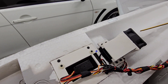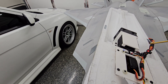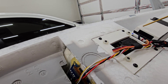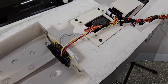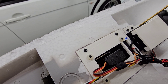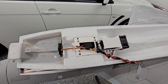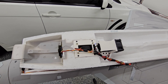This is a 40 millimeter fan that I got off Amazon — I think the fan might have been 10 bucks. I've got some stick-on heat sinks on the top of the air unit, and there's two more on the bottom. What it does is force all the air that the fan is pulling across those fins that are dispersing the heat coming from the air unit. This system is working really good. It can go for 15 minutes or so with the cowl closed, with just the VTX running, and it doesn't overheat at all. So with five-minute flights I haven't had any issues.